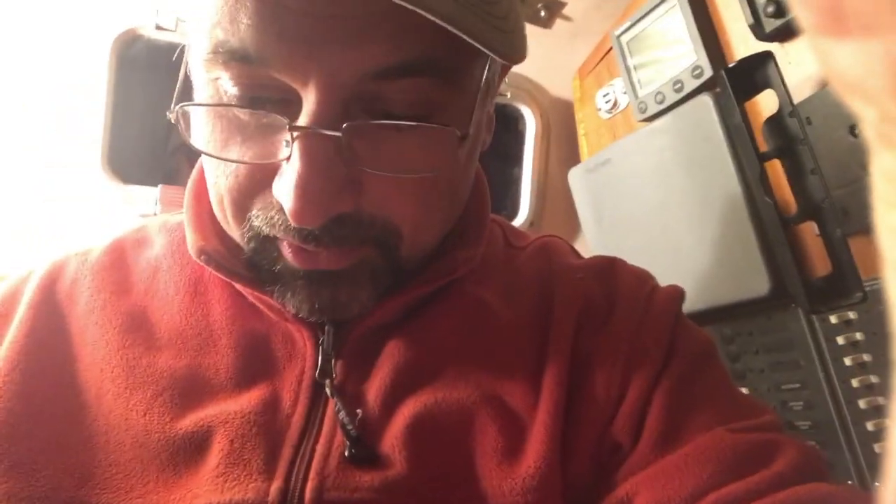Got to address some deck delamination — some small spots I noticed this season and didn't notice before. There are some small leaks in the side decks that I've already addressed, so I can probably take that off the list. There's the tiller conversion from the wheel, which is not as easy as I thought because there are parts that may be hard to come by. I may go back to the original stuffing box over the PSS shaft seal, and I'll go over why if I do that. I need to ground the mast and rig for lightning — probably doing a separate episode on that.